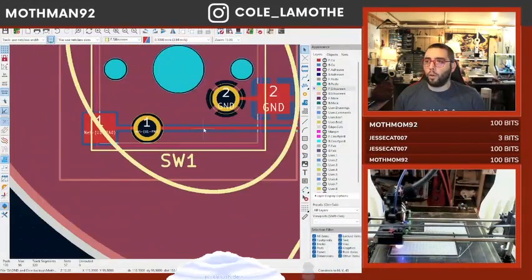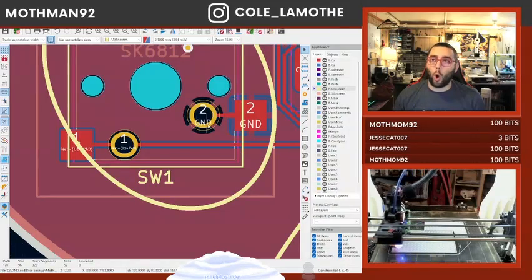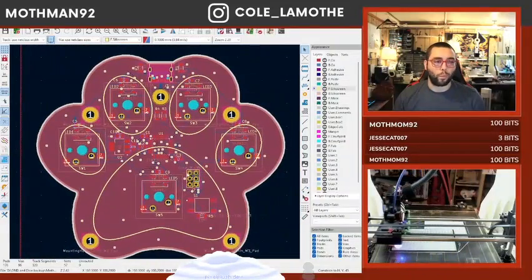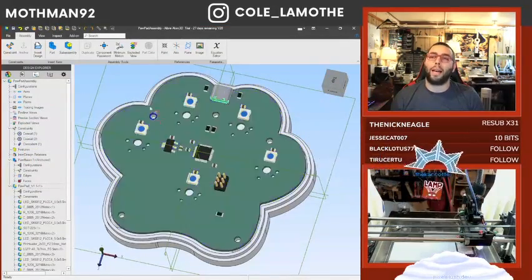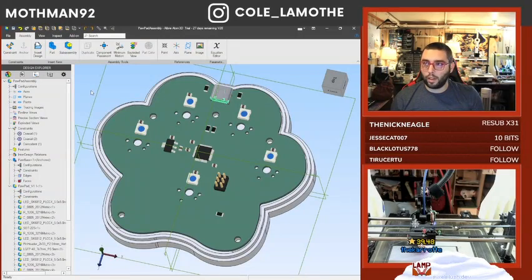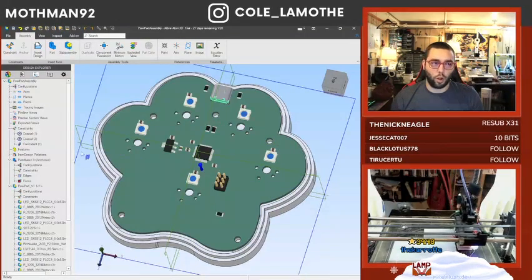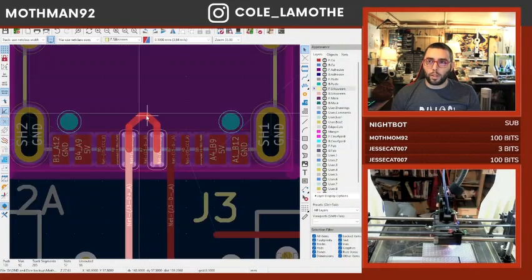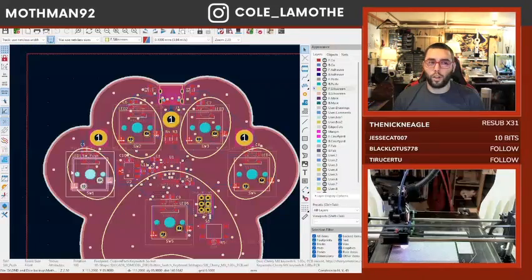You can actually see that we have both a flat pad and a hole — the flat pad is for surface mount soldering key switch sockets, the hole is for direct soldering key switches if you so choose. It'll likely be some combination of using these holes to pass up through into the lid. The USB-C is a reversible standard, so if you don't wire it properly you will not have a reversible USB-C connector and people will be very confused.